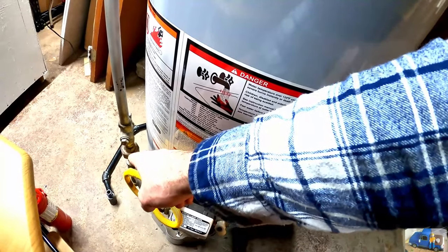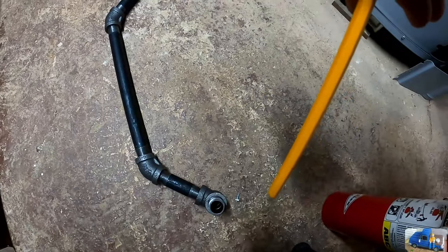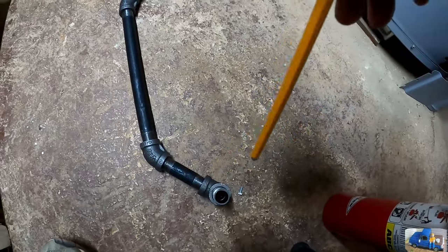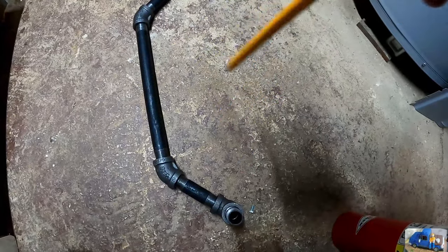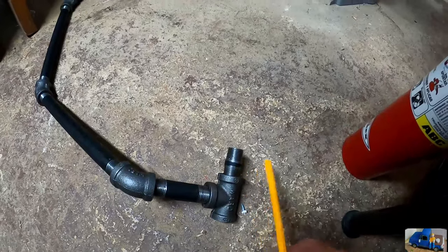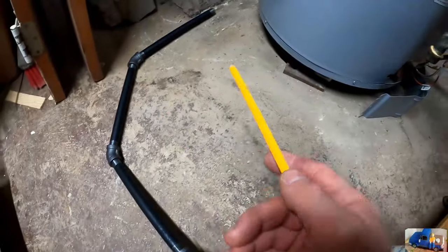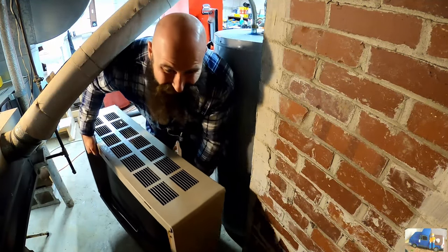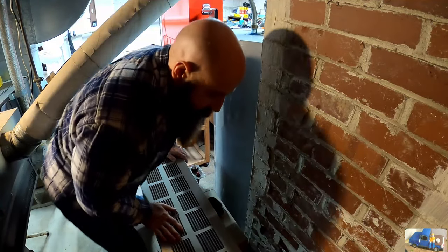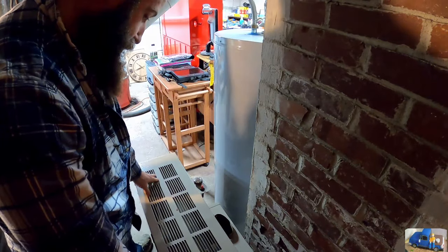This is the gas heat supply line for the hot water heater. I'll take you around to the other side, but we're going to tap in here for a gas supply. And with any steel pipe plumbing, you need to make sure you hook everything up such that you can tighten all the fittings. So we'll have to walk through this and logically think, how can we install these fittings so we can spin them all and get it in place. Probably have to start at this end. Get this NPT, obviously turn your gas off first, and then work our way all the way around, piece by piece. Yeah, I think that's going to fit in there pretty nice.